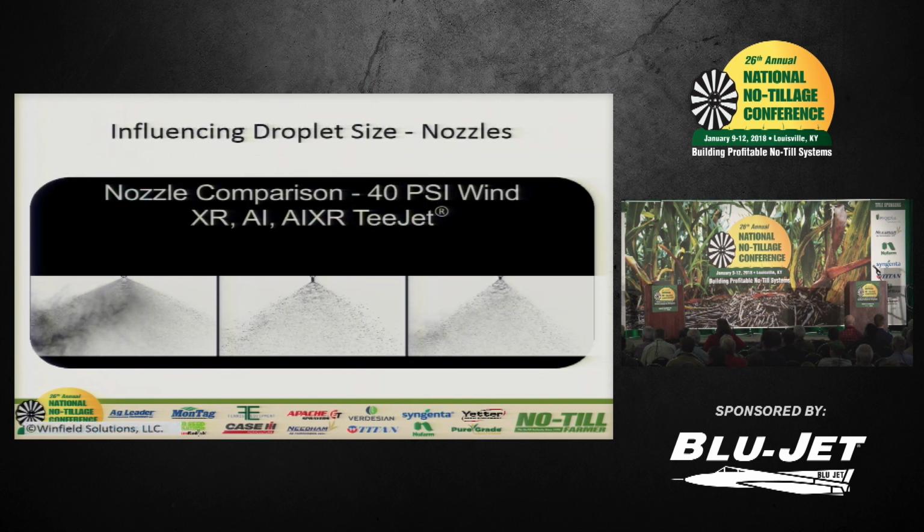Now here's a comparison of three tips. On your left is an XR, on the right is an AI XR, and in the middle is an AI. They're at 40 psi with a little bit of wind, but the reverse photography shows the amount of drift potential in the XR. You see some on the AI XR on the right, and in the middle is the AI with the least amount. So that's the purpose of that little show.